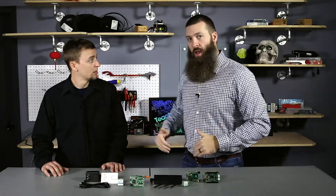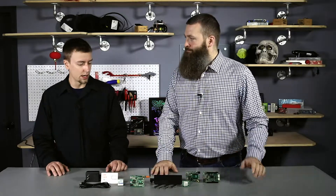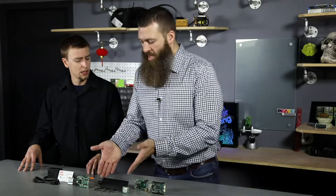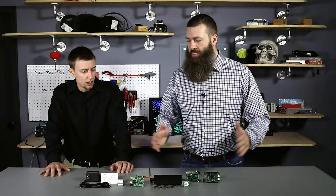Anything LTE M1 and lower — so basically M1 and NB-IoT — is just going to be a single antenna, so bear that in mind as you design your board. For larger deployments, a wider-band antenna will cover carriers like AT&T or Verizon. But if you have a specific use case, you might use a more specific antenna. Many antennas need to be small, inside the enclosure — attached with adhesive or on the board itself. Know your use case and antenna requirements before you start development.